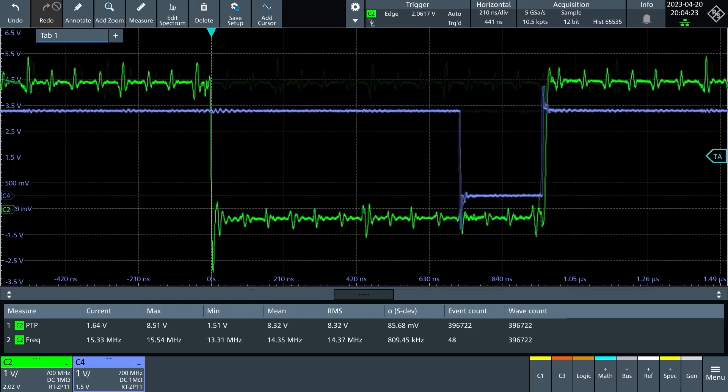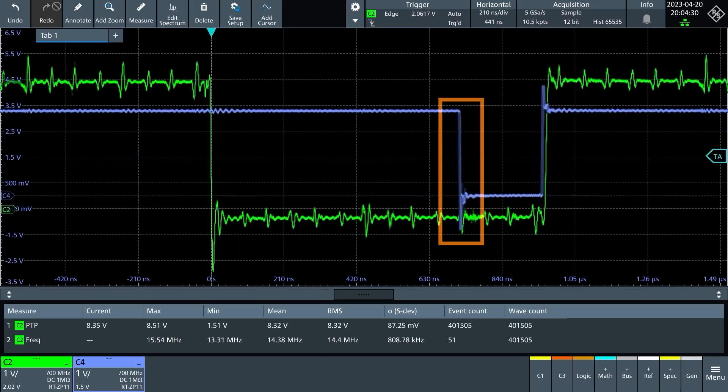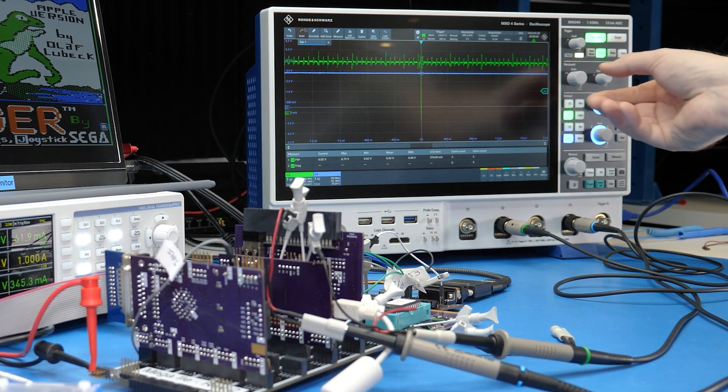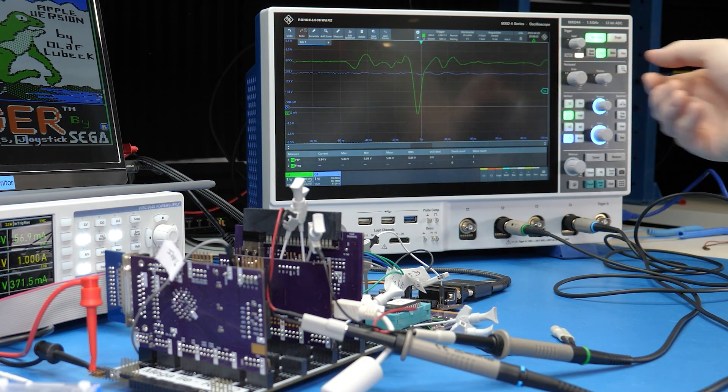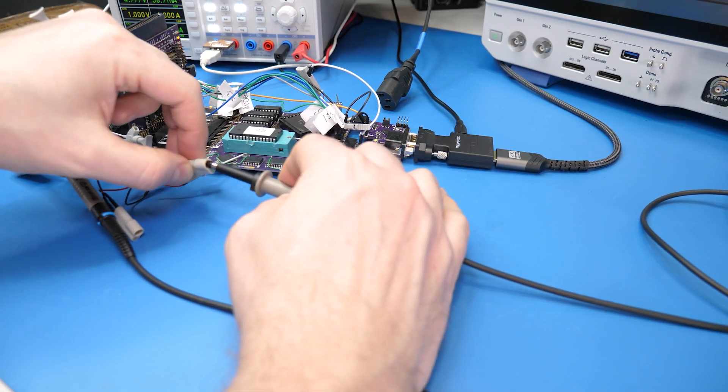In this case, I'm clipping onto the header pins because when I clipped onto the IC pins I need to look at, I couldn't get a good camera angle. Here's what I'm looking at on the scope: the green trace is a control signal and the purple is an enable. The behavior is normal — first the control asserts, later the enable does, and then they de-assert together. Now the scope is watching the control signal for a glitch. On a logic analyzer with certain software running, I could sometimes see one, so I wanted to know if it was real — and it is. The twin lead adapter makes it very easy to do this measurement completely hands-off. It is also pretty easy to move the scope probe between adapters if you have multiple connected to the same system.